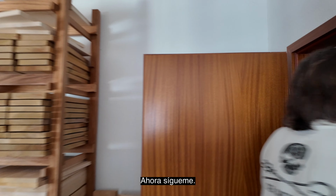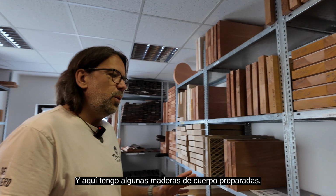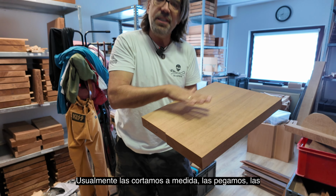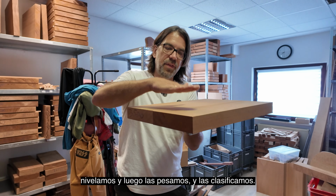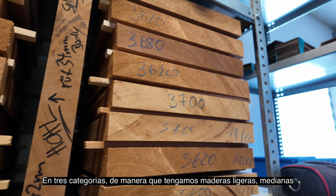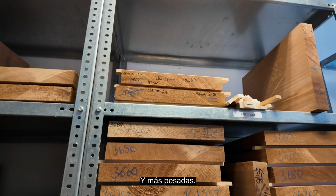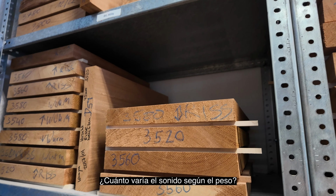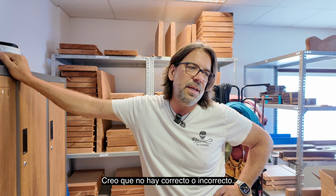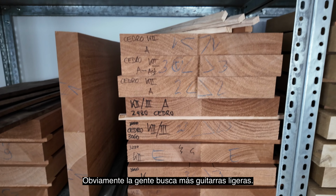Now follow me. And here I have some prepared body woods. So these are two-piece. We usually cut them to size, glue them up, thickness them, and then weigh them, and classify them in 3 categories. So we have lightweight, medium weight, and heavier wood. How much difference is in the sound depending on the weight? I think it's always difficult to say better or worse. I think there's no right nor wrong. Obviously, people are looking more for lightweight guitars.